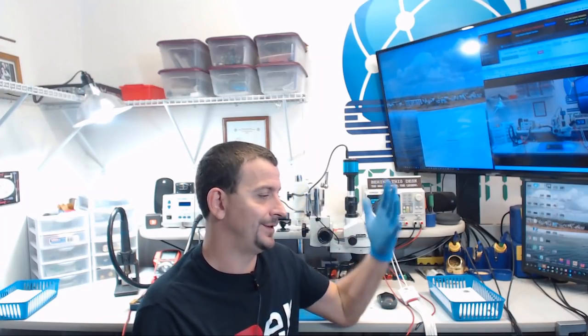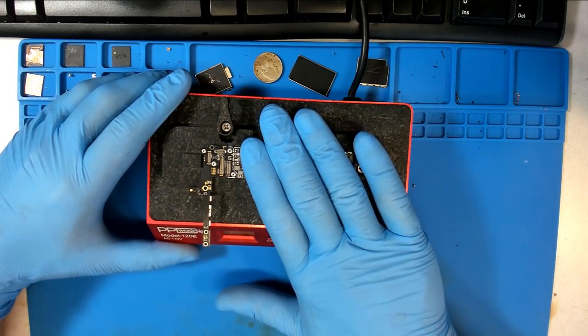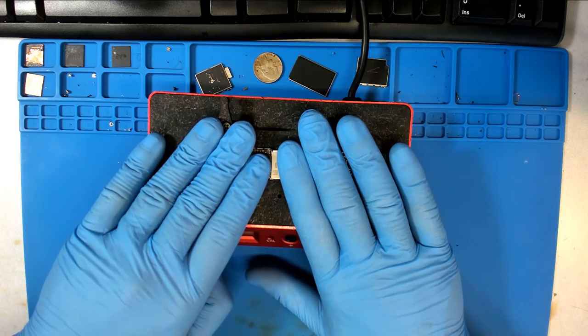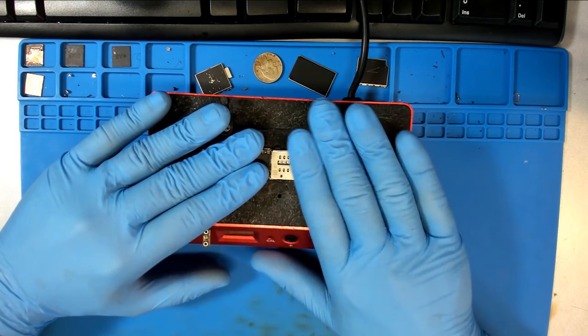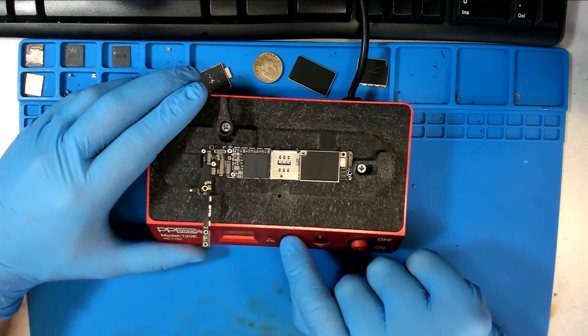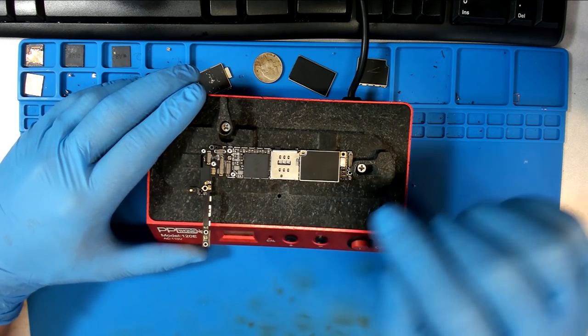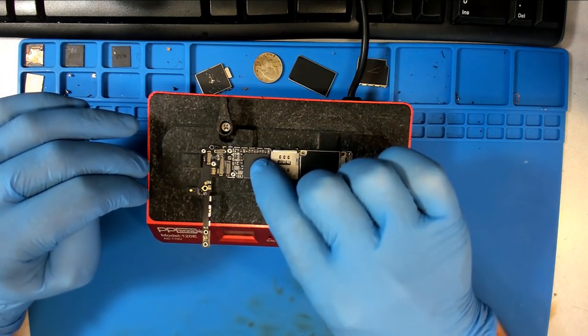I have been known to leave them on there all day long, then put them in the sun and then put them back on the hot plate. You gotta make sure these things are dry, man. Humidity is enough. You can't even have any humidity. All right, so I've had this set on 200C for a while. I know it's not really 200C because I couldn't leave my hands laying like this on 200C. This is something like just below boiling point. So I'm gonna raise the temperature up just a little bit, but not quite above boiling point. We don't want any steaming going on underneath the RAM.